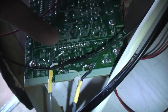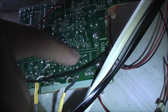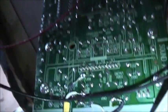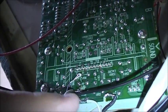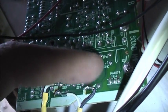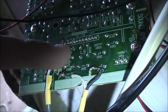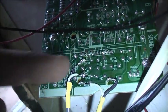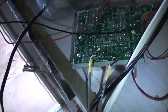So pin 1 and pin 3 — you trace those back through a capacitor. That's the positive for left; negative for left goes here through the capacitor, then through a little resistor and goes to pin 1. Now the right channel goes through this little resistor here — pin 6 is ground for right channel. Positive for the right channel goes through this little resistor, through that capacitor — that's also part of the left channel — but it also goes through to this capacitor, then to pin 5. So I've got to jump from there to there and see what happens.